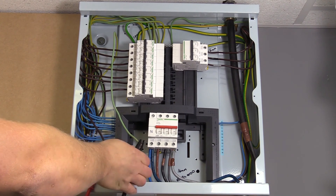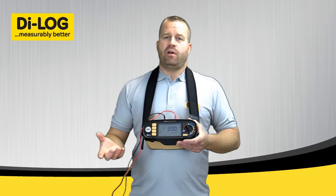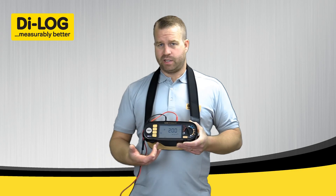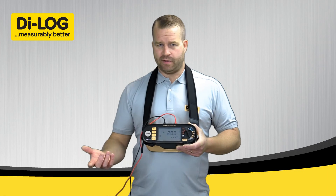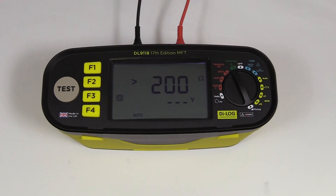The instrument is fully protected, so if you do come across voltage present on any of the conductors, the tester will automatically alarm, the screen will turn red, and it will notify you that there's voltage present, then immediately stop the test so you can investigate further. But if there's no voltage on the circuit and it's clear, the tester, as soon as it sees continuity, will automatically start.